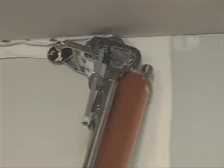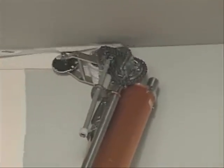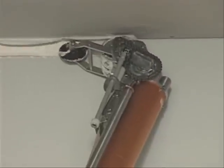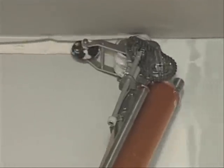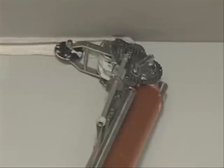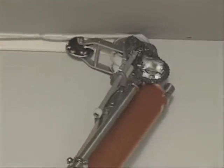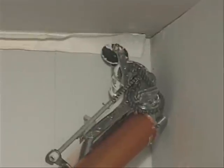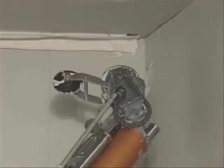In the first few feet, the creaser wheel will drag the tape slightly, taking up the extra tab length. With a little practice, you can control this drag by the amount of pressure you apply to the creaser wheel. Ease off pressure on the creaser wheel as you run the rest of the angle. Use the extended creaser wheel to tuck in the end of the angled tape.